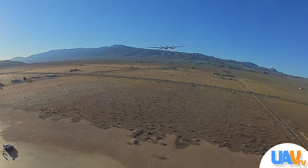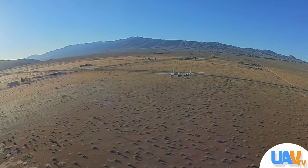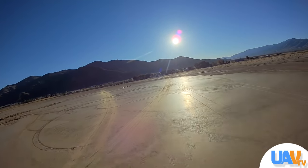It's a good feeling when you're flying around knowing your landing gear is going to work. Hopefully that'll help you guys that are having problems with stalling landing gear — just split those channels up and don't activate them all at the same time. It's just too much for the BEC coming off of those small ESCs.